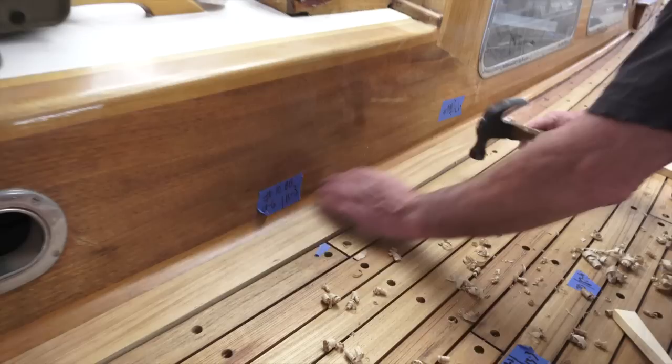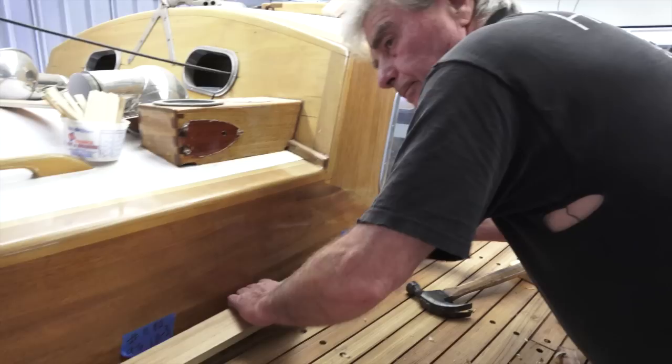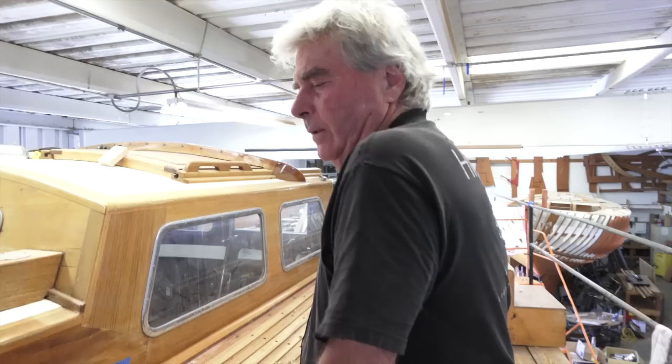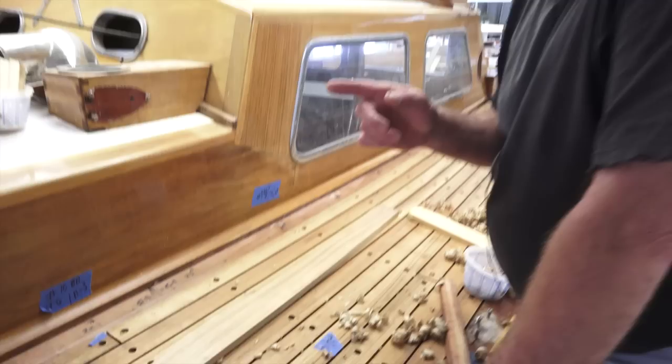It's just, you know what? I think it's sanding block time. Because back here, we're almost in. It'll actually almost go in. So, take a little wedge around. Everywhere just evenly. It's basically just a millimeter too big. Okay. Which is fine. And see, as that end goes in, we have to get the rabbet on there. Rabbet this side. Okay.